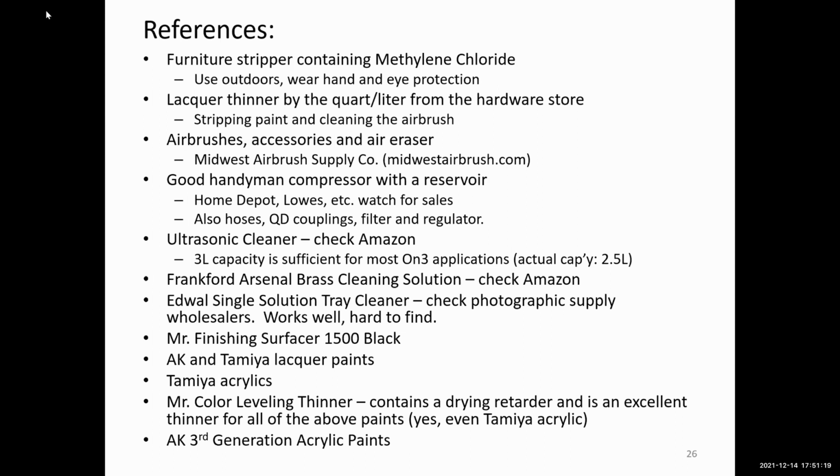There's one in that picture of the air eraser that was on there. That's actually an air eraser I've probably had as long as I've known you, Jerry. And it's got a desiccant dryer in line. Okay. A desiccant dryer is basically something the air blows through, and it draws the moisture out. Yeah. So that's the most efficient way.